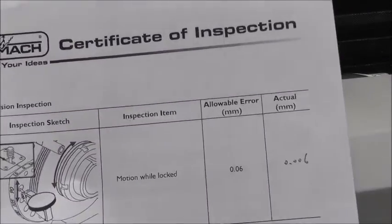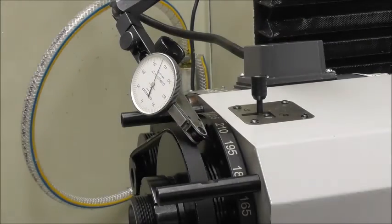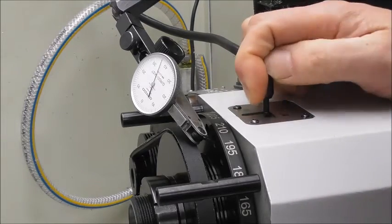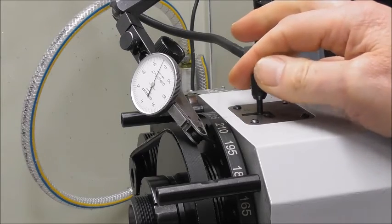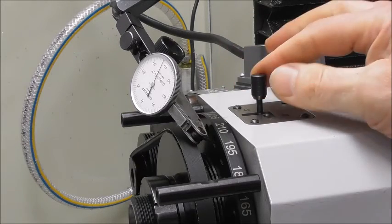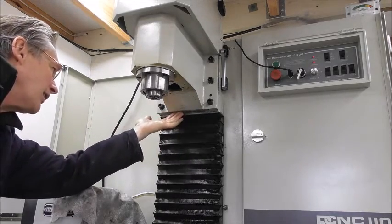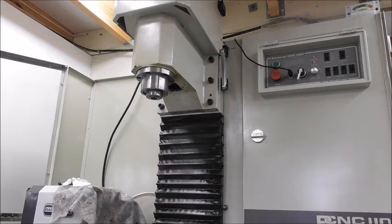The genuine certificate of inspection — apart from that one error I found just before — my confidence rises again. It's a well-made unit. The sliding key is only in the aluminium housing, so that's just a reamed hole in the aluminium housing, which won't stand up to abuse and will wear if it's subject to a lot of movement and usage. But at least when it's new it's very accurate and well made. The bottom surface of the 1100 head is machined, and I've run a dial indicator in both directions — it's level with the machine, so that's really handy. A big solid machined surface.